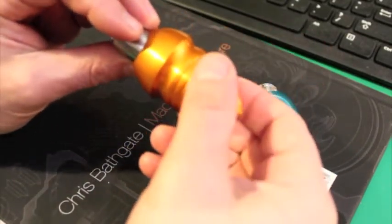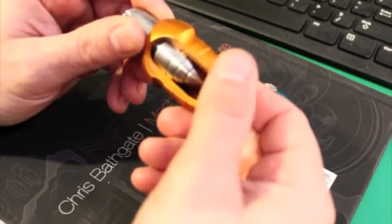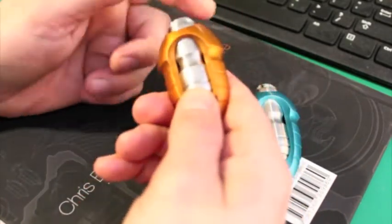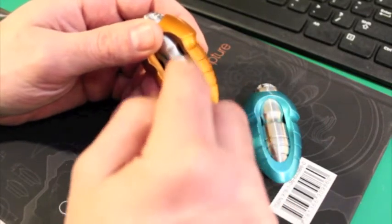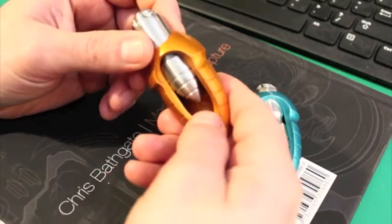The difference between this one and the original slider — the biggest difference is that this is an anodized aluminum body versus the stainless. The aluminum body with the coating is a much harder surface than stainless on stainless or stainless on brass. So once it's broken in, it actually slides really nicely.